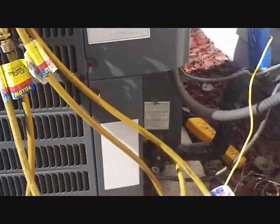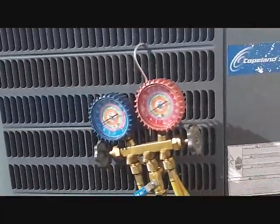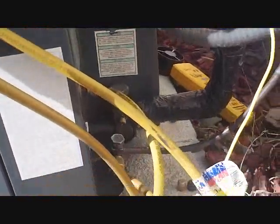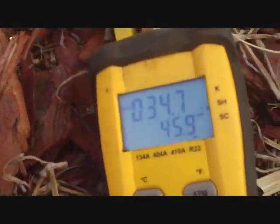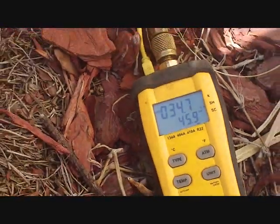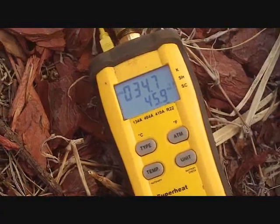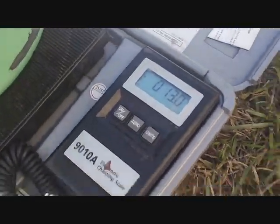We've got a Goodman GSH series from 2006, a 13-SEER heat pump. We're adding some refrigerant — it's a little low — and then we're going to go check out and see if we can find a leak. I think it's probably in the evaporator coil. We should be looking for our 20-degree superheat; we've got 34. It is charging, but it's really 34 or higher than that. We're putting almost a pound in there, so we're going to fill it up a little more and see what's going on.